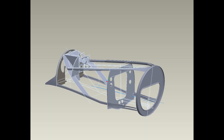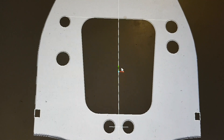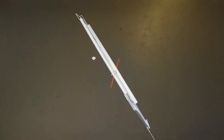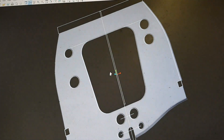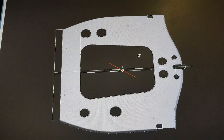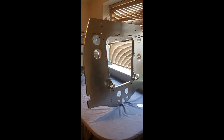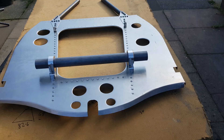The pilot bulkhead was of a much lighter construction than the two forward bulkheads, however it was reinforced with a heavy box section chassis. This chassis served two functions: it is the rigid strength member to which the pilot seat and associated mechanisms are attached, and it is also the foundation for the rollover crash pylon. The large opening in the bulkhead allowed for ground crew access under the accumulators into the rear fuselage for maintenance and service operations. Various equipment was also attached to the front and rear faces of the bulkhead, including fair leads for the flight control cables, the seating for the emergency hydraulic hand pump, and the pilot's oxygen supply connections.